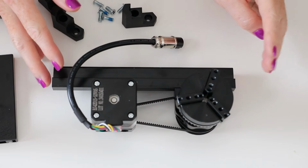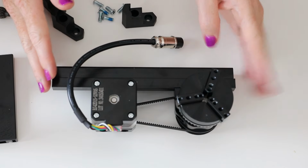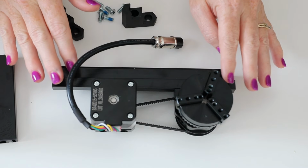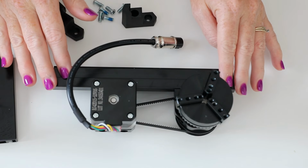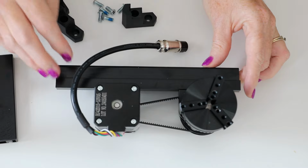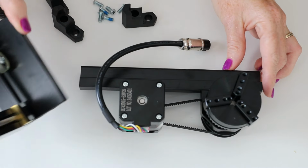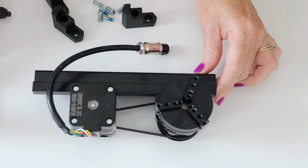Now we're gonna make a tumbler by flipping that laser head. But the first thing we need to do is assemble the rotary accessory. Rotary accessory is an optional purchase, an optional add-on. And you get this piece that we need to assemble and attach to the laser. And then there's another piece that you can use to level the tumbler itself.